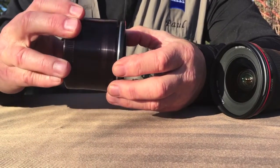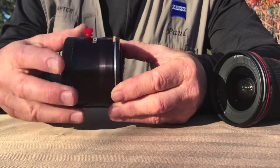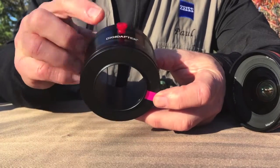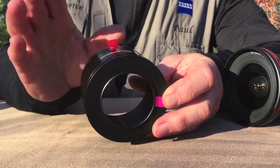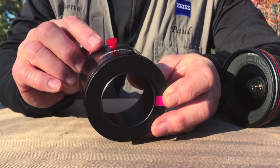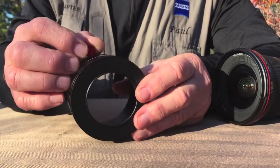You can rotate it a quarter of a turn. And now, if you notice, the marks here and up here. What this has done is rotate your lock screw to a position that's convenient. So you have 4 choices: 12 o'clock, 9 o'clock, 6 o'clock, and 3 o'clock. Those choices are available to you to keep the lock screw convenient.